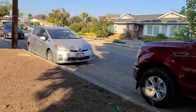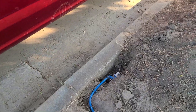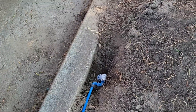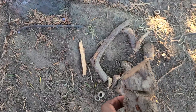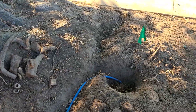Yesterday I worked on the irrigation system and found a broken line. We had to come in and fix that using blue lock fittings and PVC lock fittings. A root had actually created the break, so we cut all that out and basically bypassed all the rest of the heads in that area.